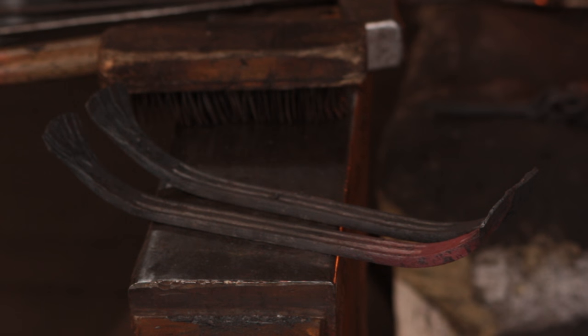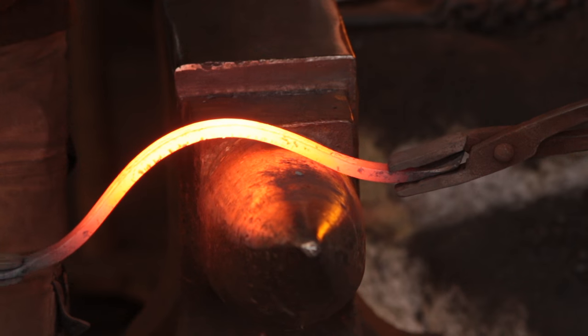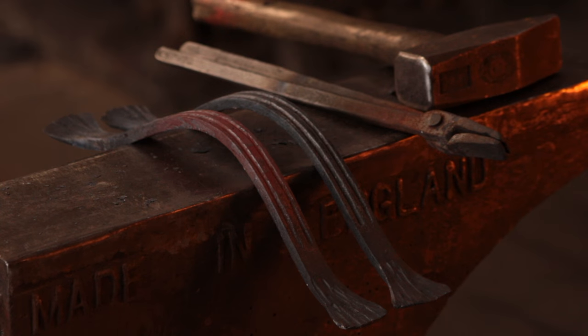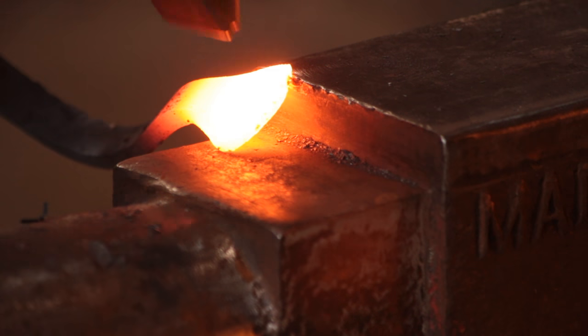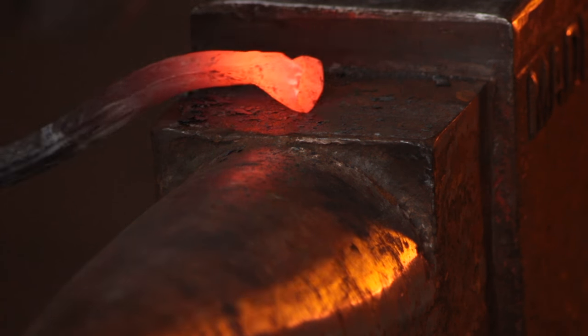It's not 45 degrees either — I literally did that by eye and what looked right. I haven't got any measurements or angles for it, but I made all four ends the same, and that will allow us to then bend the bar itself in the middle. It's important to get a nice even heat throughout the whole length of the bar, but keep the ends as cool as you can — that'll save them from losing those original bends. Then it's just a case of going onto the face of the anvil and flattening the fishtails out. Make sure you're getting both bars to the same stage at the same time — that'll help you stay more accurate.